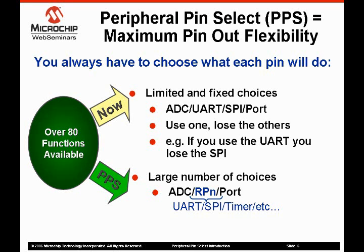If a typical microcontroller was designed with multiple UARTs, SPIs, and I2Cs, their use would be limited by the way the pins are typically multiplexed. In most microcontrollers, the functional inputs and outputs of a peripheral are typically multiplexed on fixed pins and often conflict with each other. This creates a situation where by selecting one peripheral, you lose the ability to use another. If a microcontroller manufacturer included all the needed peripherals in an IC, it wouldn't be possible to access the peripherals needed.